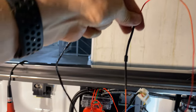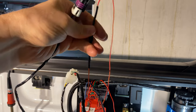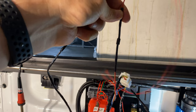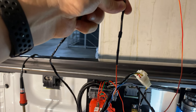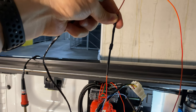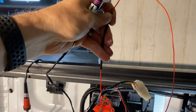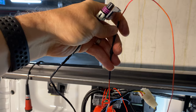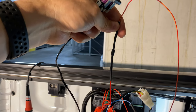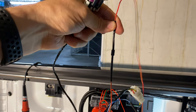The diode — this is not a resistor, it's a diode. It's to stop basically any stray currents and things coming back because of the motor turning on and off. You need it, and it can only go one way. If you screw it up and turn it around the other way, power will not flow. A lot of people don't know what it is, but it's just a one-way electricity flow — you can send it one way and it stops everything coming back. So if you turn it around and put it the wrong way, electricity won't flow and your air compressor won't turn on.